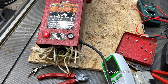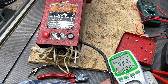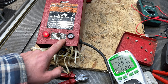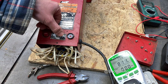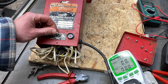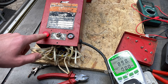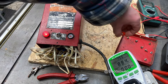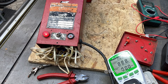Bizarrely, that fuse has killed the 110 volt light. This is weird. And it's gone to 88 watts, which I'd call 80 watts. Let's try switching it back - we're getting nothing there, zero watts. But if I put it over there, the light comes on, back to 88.9 watts. This is quite bizarre - it was heating up before at 350-400 watts, and now it's back to around 400.